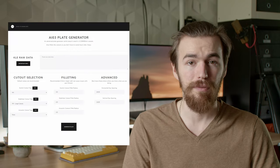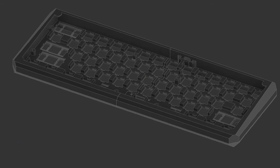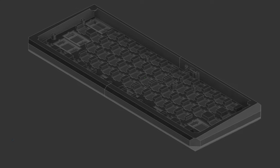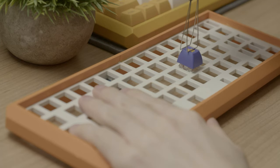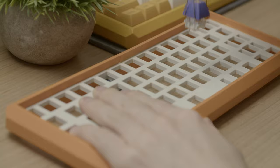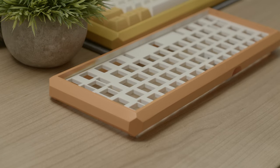The plate was a bit more effort and took me some iterations. I used the plate generator for the first time until I noticed that I was missing cutouts for the stabilizers and they weren't the right size, so I needed to update them all over again. Very importantly — and I can't stress this enough — the plate can only be 1.5 millimeters thick. Otherwise the switches might not sit securely and you might pull them out with the keycaps. That's why I have this otherwise fully finished case here. Next time I'll most likely print the plate separately so I don't need to reprint the entire keyboard.